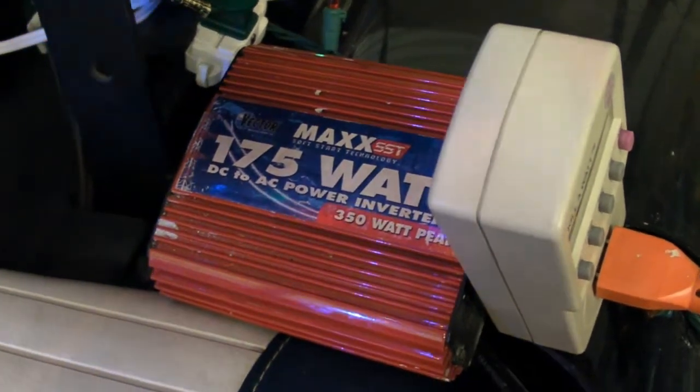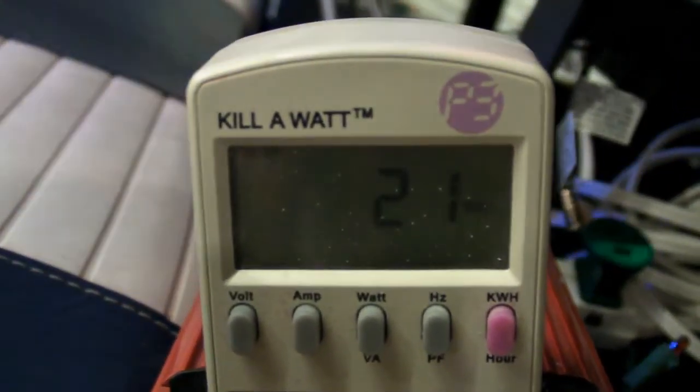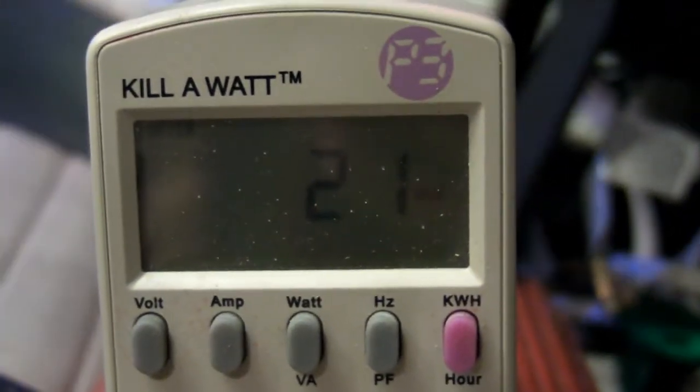When the system was running, not all the LED strings were actually on at the same time, so the entire system — including the embedded processor and wireless router with the lights that were on — drew only an average of 20-30 watts of power. This was perfect to make the light show last the entire night and not kill my battery.